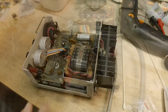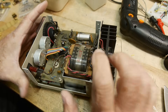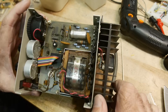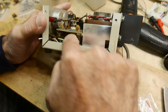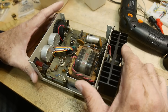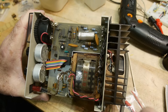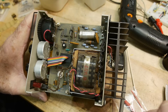It's nicely packed - the transformer fits in nicely. It has a little bracket and all the wires are twisted together, which makes it neat. Here's a capacitor that probably needs replacing - 50 microfarads - and underneath there's a big one, actually two of them down there. Those are going to need replacing. Without a schematic we're going to have to guess, but it's probably pretty straightforward. It looks like there are two bridge rectifiers and one op amp that does the voltage regulation, plus a couple of diodes.